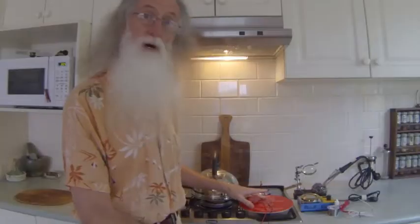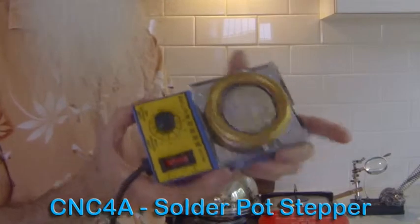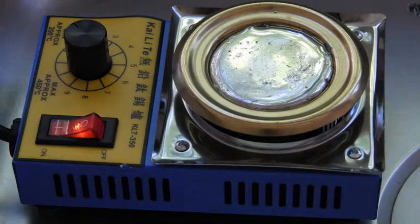The other wire, which has silicon in it, is high-temperature wire and that's soldered to the bottom of the hotbed. When I tin the end of a thicker cable I like to use a solder pot. It's a pot where you buy a big chunk of solder, break it up, put it in, switch it on and melt it — the pot stays permanently hot.